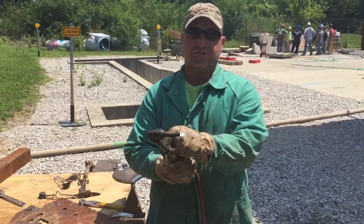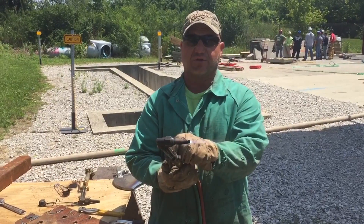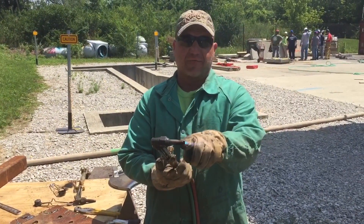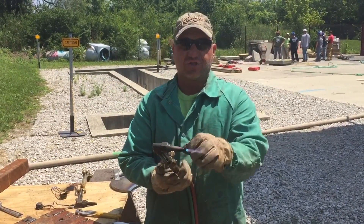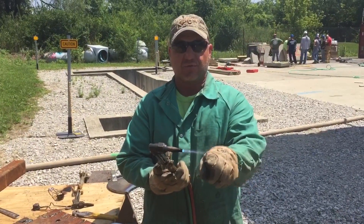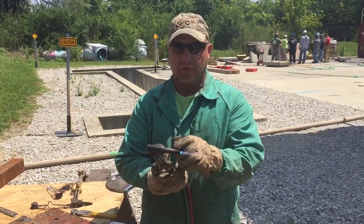You notice right here there's a slight separation. Slowly bring in your oxygen until you achieve what we call a neutral flame, which should look just like that — it should have a four to six inch outer plume and about a quarter inch inner cone. When I hit my cutting oxygen valve, that cone should just get brighter; it shouldn't lengthen or shorten. The only thing that should happen is your outer plume will shorten up and the inner flame will get a brighter shade of blue.